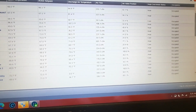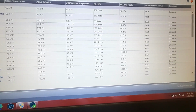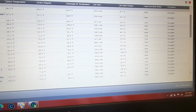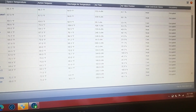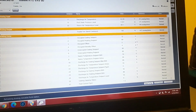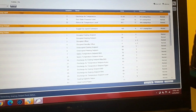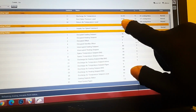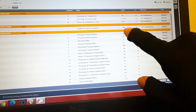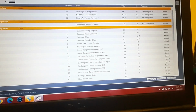We're doing really well. I've got some parameters to go through on the drive. I had to button it back up so I didn't get rain on everything yesterday, but we're gonna go through the drive and see if we can get this thing ramping down like it's supposed to. All right, so let's see if this works. I basically reset the drive to factory defaults and went through the parameters I needed to, and I'm at 35 Hertz right now, and you can see I'm 0.5. My problem is the drive's looking for a different command because of the way it's set up.